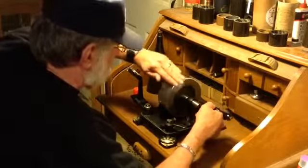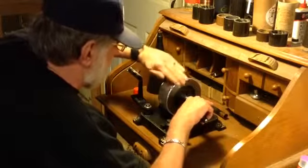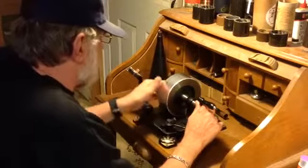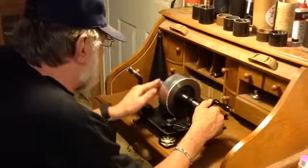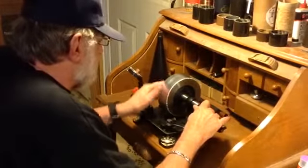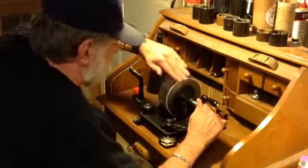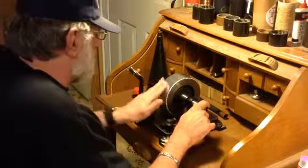I'm really curious to see how this has fared staying in adjustment. I haven't had any time at all to play with this tin foil phonograph — I've been busy recording cylinders. I'm getting down towards the end of the roll of this foil, so I'm going to have to get some more. When you get to the end of the roll, it begins to leave wrinkles in the foil because it's so tightly wrapped on that cardboard tube. I'm seriously thinking about making a small table of some kind to cut this foil — it's really tedious to trim a strip to length. This strip of foil is 18 inches long and this is a big mandrel.